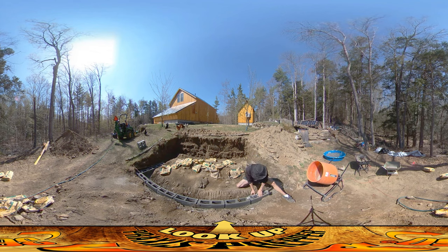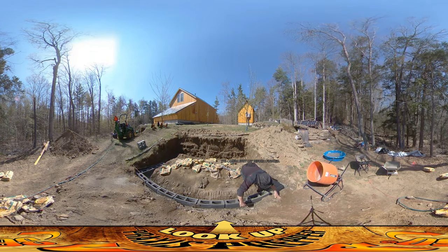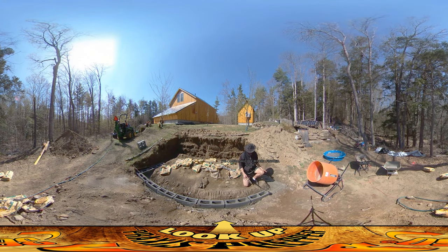I'm pleased with that, it's looking pretty good. I've got a little trowel here and I use it to just push the concrete up against it, kind of go into the crack a little bit. I'll be filling the cracks in more later. But this allows me to grab concrete and make an extra thick bed for the next brick that's going in so that I can push it down into the concrete. The best way to make them nice and level is to have a nice thick bed of concrete that you can kind of work your way into.